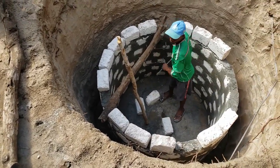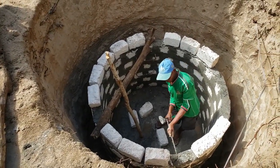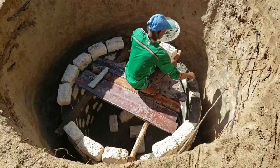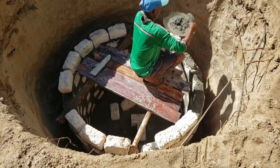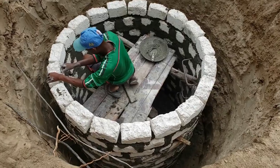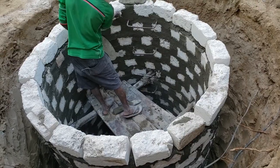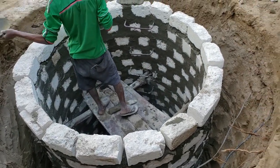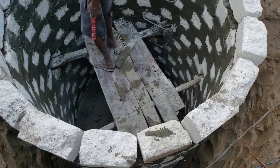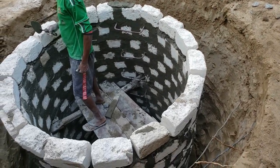Now they're making something called a chukwa — scaffolding they can stand on to build the next row of blocks up. He's continuing this row, and where the poles are, he'll put a small block so the row can continue. The fundi has gone up about three rows. We may put one more layer of blocks, let it dry, and after that dig down inside until we catch water, remove enough sand, let the well drop down, then add more rows of blocks.